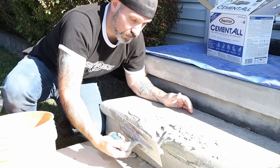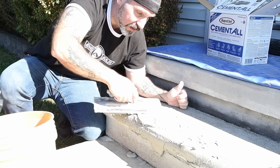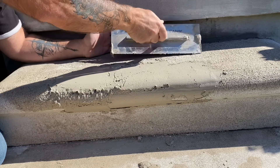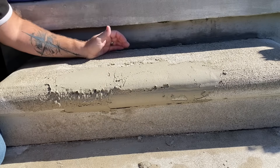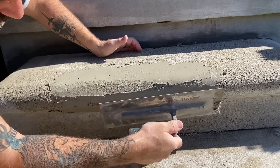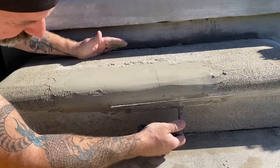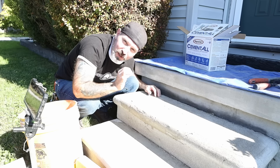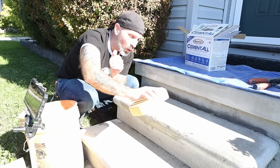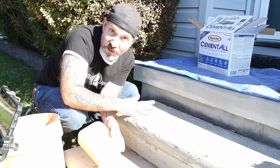So pull it towards the substrate — starting all the way from the bottom, rounding up and towards. However you feel comfortable, do whatever you need to do to shape and form your repair. At this point, I'm going to let this set up for a few more minutes to let it stiffen up just a little bit more before I add those finishing touches and before I take a damp sponge and run it over to blend it. At that point, I could be done with this repair.